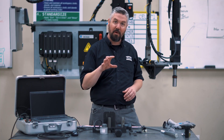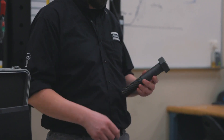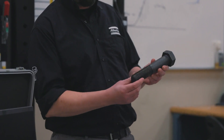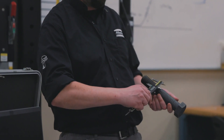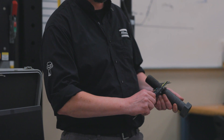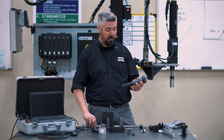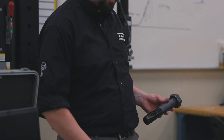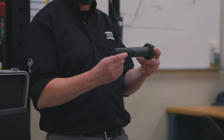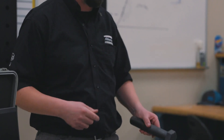You're going to be able to tell by the head of the bolt if it's English or if it's metric. Now we're going to identify the size of the bolt. The bolt size is determined by the diameter measured across the threads — we measure that with a pair of calipers. This is 1.49 inches across, which means this is an inch and a half bolt. The length of the bolt is measured from under the head. We grab our inch ruler and measure this at eight inches. So this is an inch and a half bolt, eight inches long, grade eight.